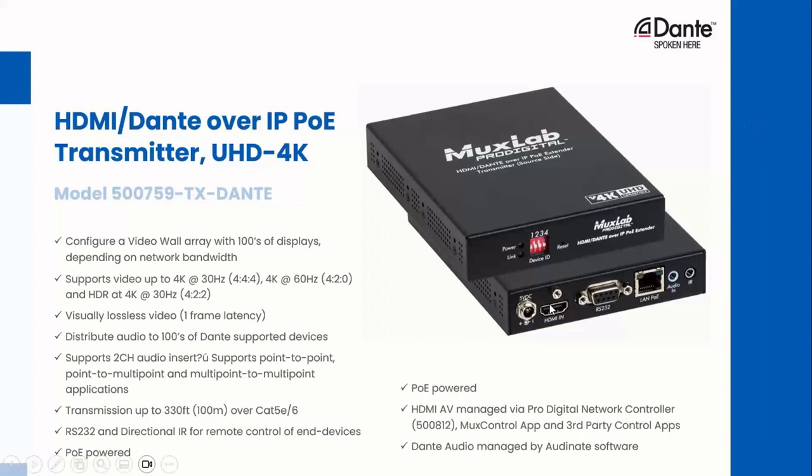But in addition to that, both the audio on the HDMI and the 2-channel audio being embedded on this port here, the 3.5 millimeter jack, both those signals get tapped and a copy is made in Dante format and put on the network. So it can be picked up by any Dante devices like the Dante speakers that we saw earlier. This also works with our AV over IP family of products, which we're not going to be talking about today, but I just wanted to mention this one product because it does support Dante.